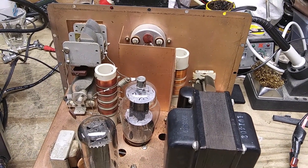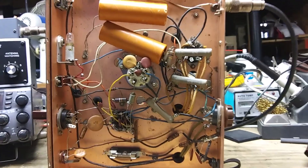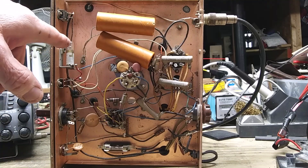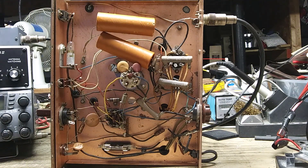That is the Johnson T50 transmitter. By the way, it doesn't say T50 on it — it just says '50 watt transmitter' — but it's known as the T50, and in later catalogs they did eventually put T50. This is Paul, AA1SU, 73. I also want to show you the underside of the radio: here are the original filter capacitors in the power supply, the pilot light, the crystal socket, a fuse, the octal socket, some tube sockets, and other components. It's all point-to-point wiring and was kit-built — looks like somebody did a really nice job.